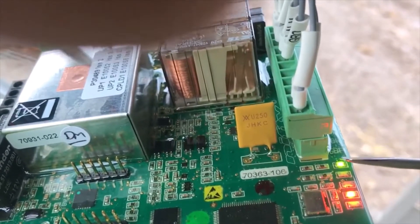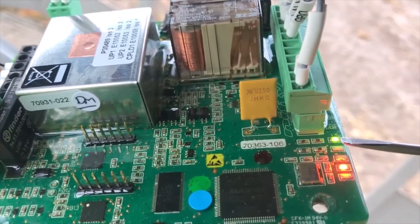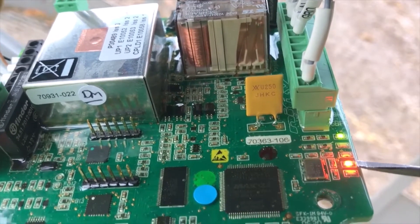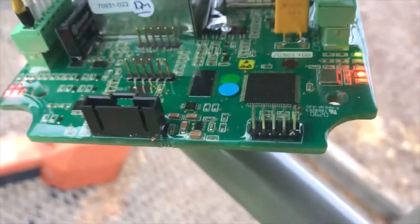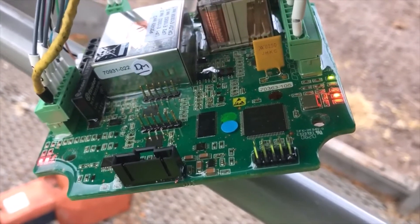So this green LED here is enabled, meaning the board is checking the cage weight and the weight is in safe range, showing that everything is okay now. This other LED here - I think what it's showing now is showing negative load, because it's not been calibrated. It's just a new board from stock, not calibrated. And if I push the cage down a bit, I think that LED is gonna go off.